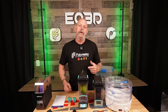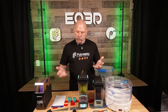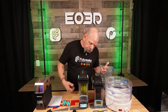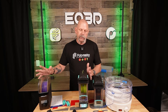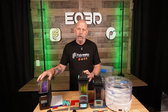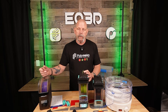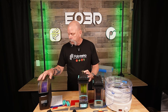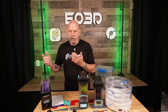That's what I was able to get using this thermometer — I would set it to run for 30 minutes and then take a 10-minute timed average. Do I think it's necessary to have a temperature display on there? No, I don't, because I use this one mostly for ABS, ASA, and nylon, and I just crank it wide open and turn it on — 6 hours for ABS and ASA, usually 24 hours for nylon. It works. You can print from it — it's got a little port on the back as well, with ball bearing rollers inside for the spool to turn on.